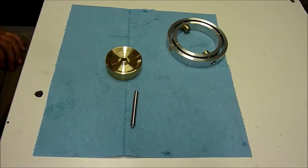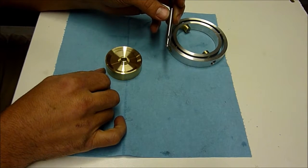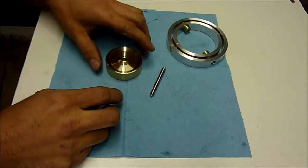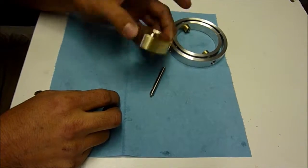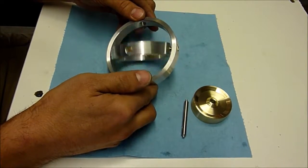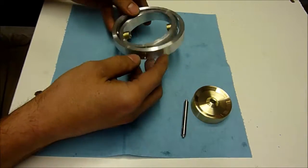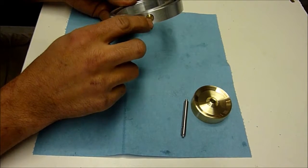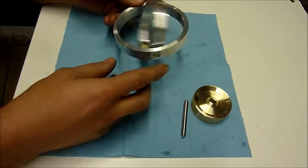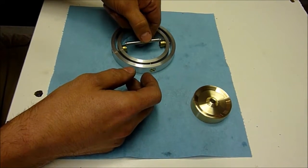Okay, we've got our rotor and our axle finished up. On the axle, I drilled a through hole for our pull string and chamfered it and cleaned it up a little bit, just lightly sanded it. Likewise on the rotor, I finished both sides. And then I also put together the inner and outer gimbal rings. The bearings that we had put in there previously are riding on a shaft here. We used the slitting saw to slit the brass, and so I just put those in there, and that's how the inner gimbal will work. And then the rotor is going to be in here between those bearings.